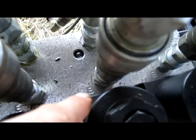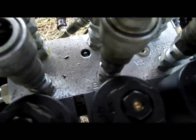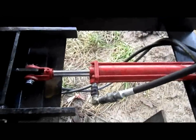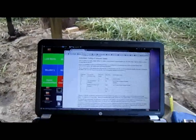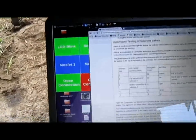The particular connection for driving the cylinder back and forth will be port A and port B. Port B is closer to the solenoid valve and port A is the one farther. It turns out that port B goes to the bottom of the cylinder and port A, the way the code is set up right now, goes to the top of the cylinder. That allows us to run the test code for the secondary cylinder with success based on the correct orientation of the magnets, which are set by the GUI shown before.